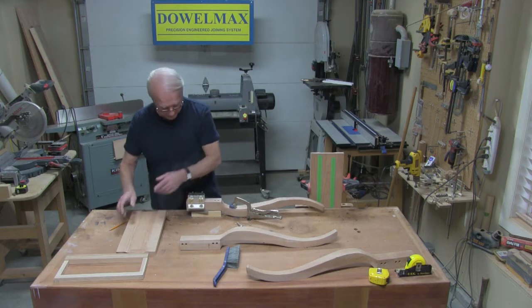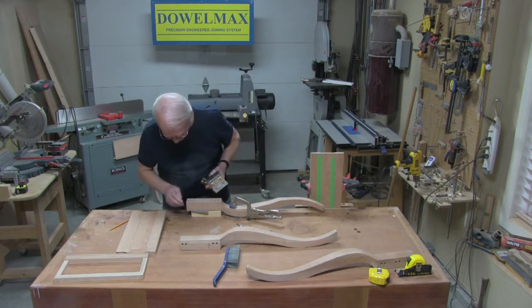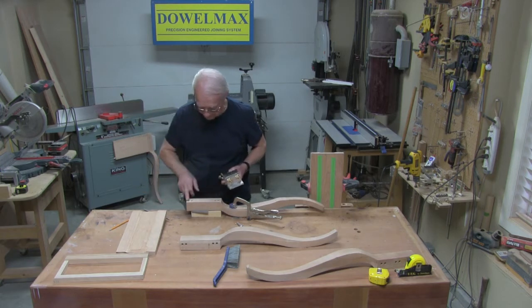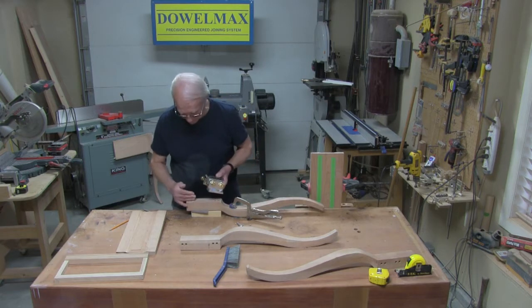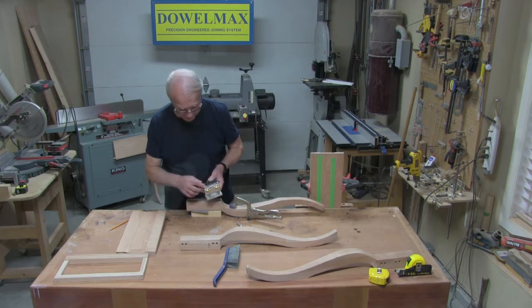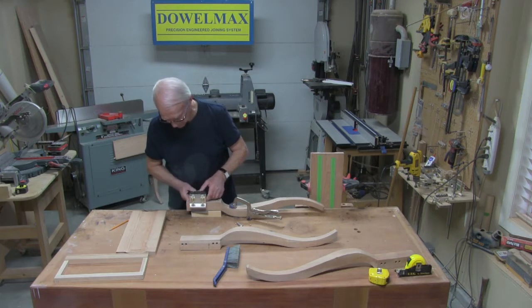Now to do the leg, your check marks are here and there, and your X on the surface to be drilled is here. So in order to give a 3/8 relief, and we're referencing from the front on this one, install a 3/8 spacer, and I've got a little 1/8 spacer in the back here just to spread the jig in order to fit over here.